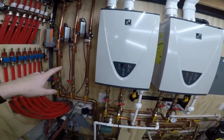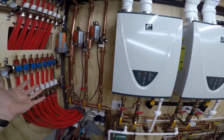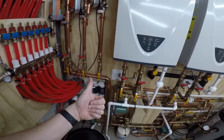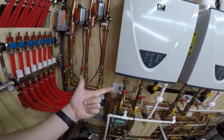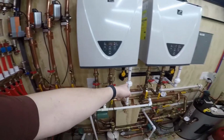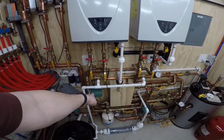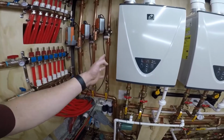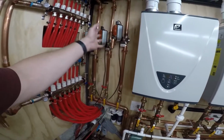And in that one wire, there will be how many different strands? One will bring power in whenever the switch is on, right? One will carry power back whenever the aquastat's on, because then I can put my relays in there to control my pump. Because now that we figured it out, each zone's gonna have its own relay because it will turn on the other valves.